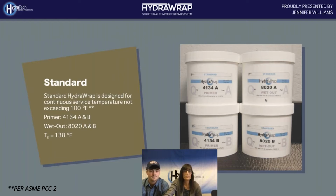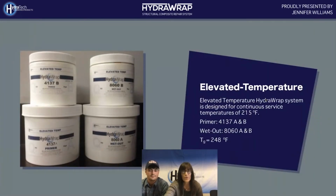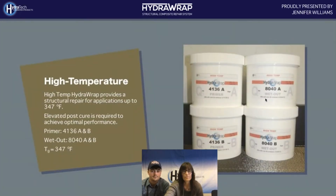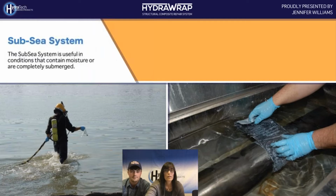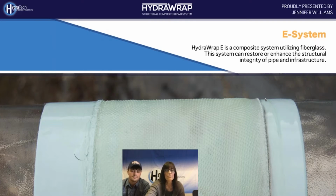This is our standard, which is designed for temperatures not to exceed 100 degrees. The elevated temperature is not to exceed temperatures of 215. The high temperature provides for structural repair for applications up to 347 degrees. The acid resistant basically is for applications where the HydraWrap will come in contact with aggressive acids. Subsea basically is self-explanatory. Anything that contains moisture or will be completely submerged. E-system is for utilizing the fiberglass, not the carbon.